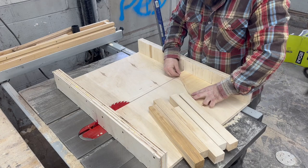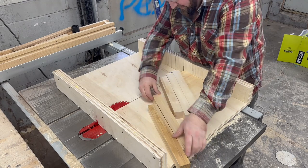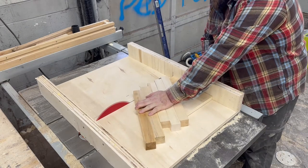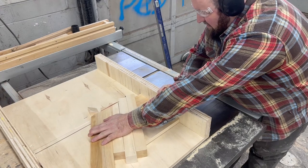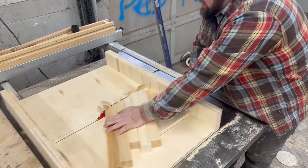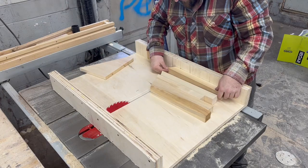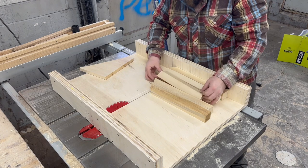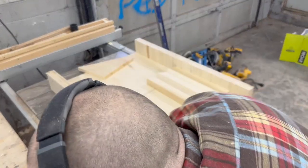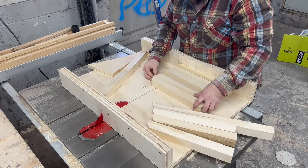I've got a cross-cut sled here that I made out of plywood, and I cut a little angle block to the angle I want on the tops of my pieces. I'm just going to line them up on this to batch cut a bunch at a time. I started out on the miter saw but since I needed about 300 of these, cutting one at a time was going to take way too long. If you're not comfortable doing this, stick with the miter saw, but for me this was much quicker. I get the bump stop out of the way, line pieces up on a mark — I was cutting them at two inches tall — and I can run them through a second time with a straight cut, cutting 10 to 12 at a time instead of one at a time.